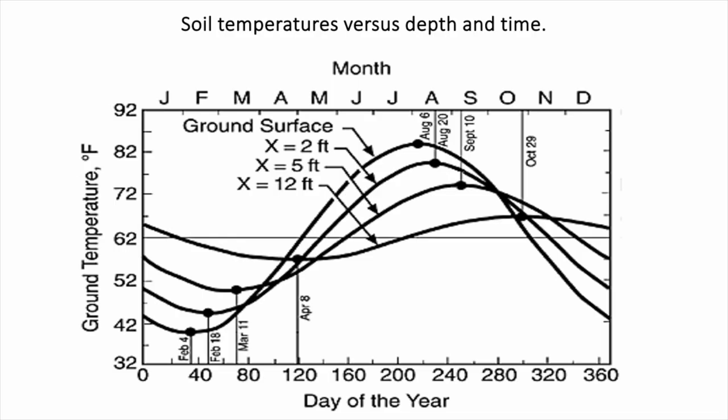Other possibilities for significant design improvements provide good reason for optimism. Careful consideration should be given to the depth in the ground where the temperatures remain highest during the winter when heat requirements are greatest. As this graph suggests, deep placement of ground loops or the use of groundwater is normally best. The unique circumstances that exist for high tunnels were much of the basis for the proposed geothermal design in the current project. Because of the misfortunes, this system has yet to be tested.